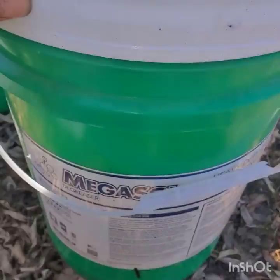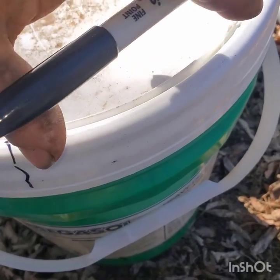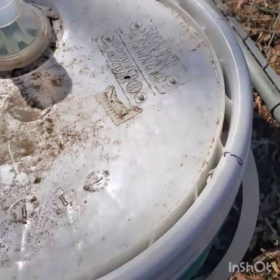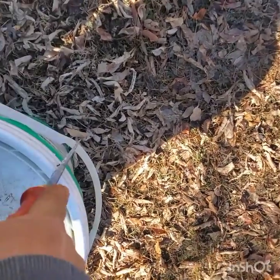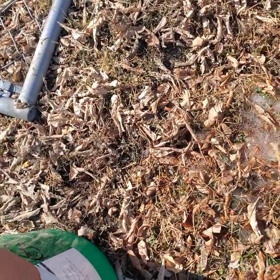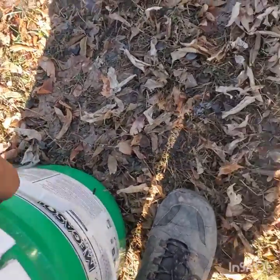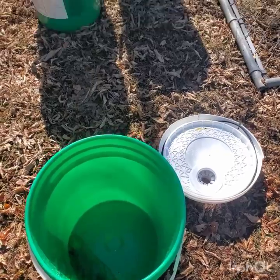To start, we're going to remove the lids. Some lids have pull tabs at the bottom so that they can be pulled and then just pried off. These do not, so we're going to cut about every 6 inches, which is about a hand finger-to-thumb length, around the pail. When cutting the lid off, remember to cut up and down so that you're not actually cutting into the pail. Once we've got our cuts made, we just reach in between the cuts and pry the lid off in each section, giving us an open pail. One down, three more to go.